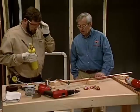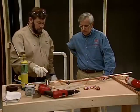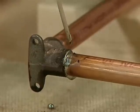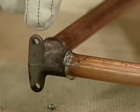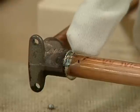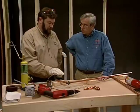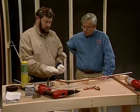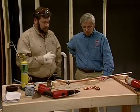Well, that's one. You seem to know exactly when to apply the solder — what are you looking for there? There are two things I'm really looking for. When I was rolling the solder around, this is my temperature gauge and I can feel it actually melting. But if you look at the pipe here, you can see it's starting to change colors. The brass fitting is actually starting to change color also. You're getting the fitting fairly hot, and if it starts turning blue or black, you're overheating it. What's the consequence? At that point the flux I put on there is going to burn out — it's not going to protect the pipe and fitting, so they'll actually oxidize in there and the solder won't take. If I opened up that fitting, inside it would just be a black spot, and we'd probably have a leak.